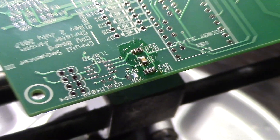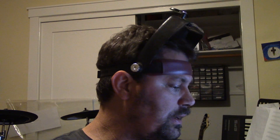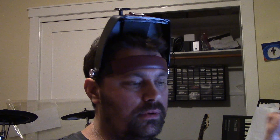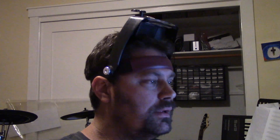Before I finish I'd like to add that after you're done with all this you're going to have to clean the flux off the PCB board. Even if you use water clean or no-clean flux, I try to clean it off because it just looks nicer. Make sure you clean it off within an hour or so after a soldering session — solder, clean, take a break, and continue. It's a good way to break it up. Okay, this is going to be really cool — we're gonna have CS80s! How cool is that? Okay, bye!